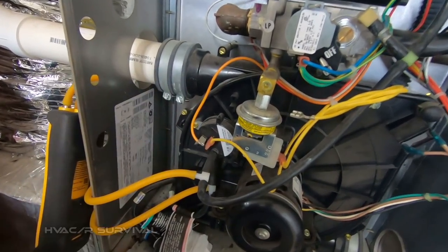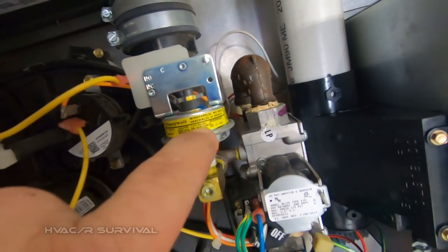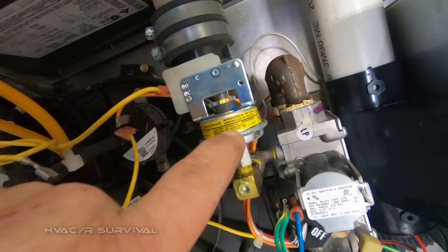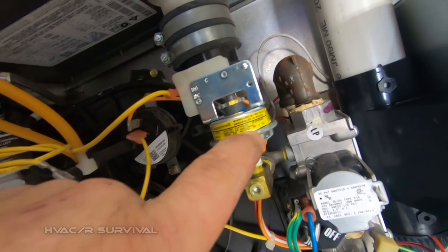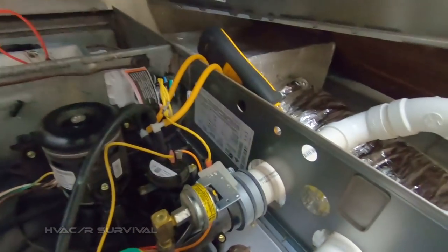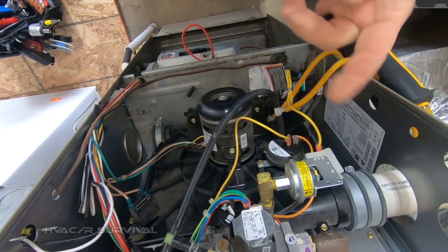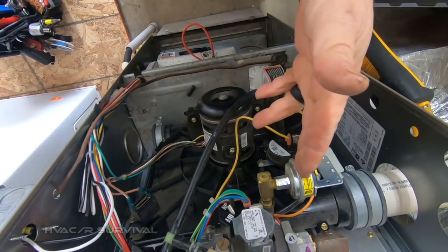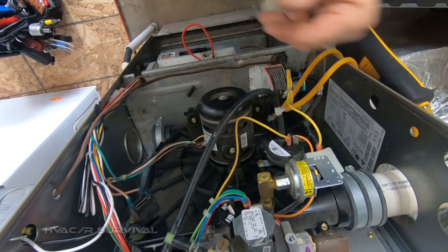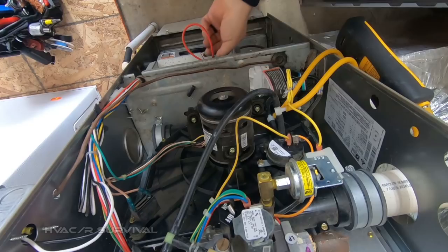She's not acting up. Let her click. Looking at the pressure switch — the diaphragm membrane, vertical or horizontal, natural or LP gas — so that's horizontal. This thing has been installed since 2009 or 2010. Why is it just now acting up? Might be the rubber diaphragm — it's a little cooler out right now. Why did you get away with not wearing your seat belt for how long? We're going to go ahead and shut her down and put these back together.